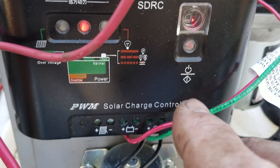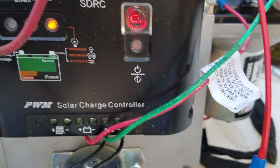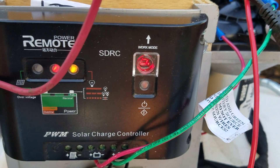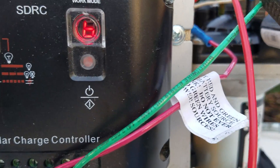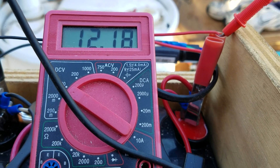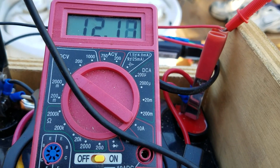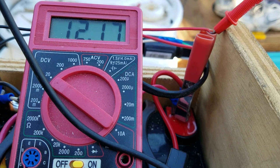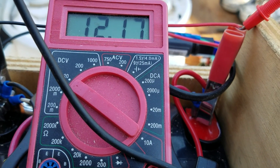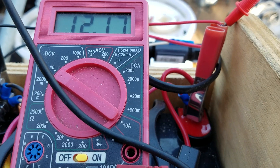Now if I want, I can come over here — there's a manual button. If I press this manual button, you hear the click, you see the yellow light on right there, and that's showing that I'm putting power out through the red wires. The display in there says six. Now that's going to bring my battery power down — we're down to 12.18 now. I watched it running just like this, and that's actually heating water right now. It doesn't go much below this range, so it's not going to kill my battery. The battery will work and heat that element, but I'm also putting a charge in there with the 13-watt panel right now.